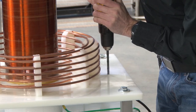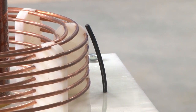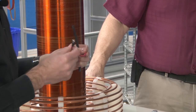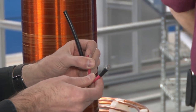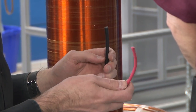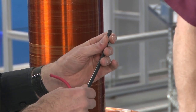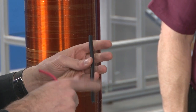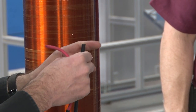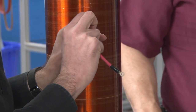The output is the same or better — much better. And now we've replaced the test wire. Here's the little stuff and here's the good stuff. This is like 20-gauge test lead wire. It's GTO cable — really heavy-duty silicone insulation, very thick, rated for 15 kilovolts. And this is really tiny wire, it's like 20 gauge. This other one is, I think, 12 gauge — it looks and feels like 12. It's not actual GTO cable, it's something different, but it's rated for 15 kilovolts. It's got a hard outer jacket and a soft gooey inner jacket, and there may or may not be some shielding in there.